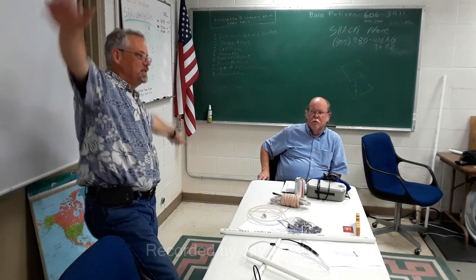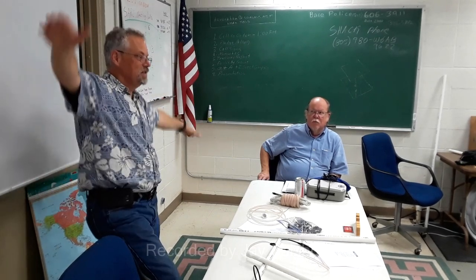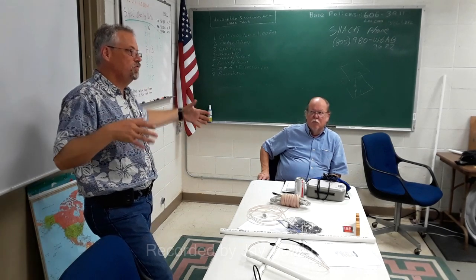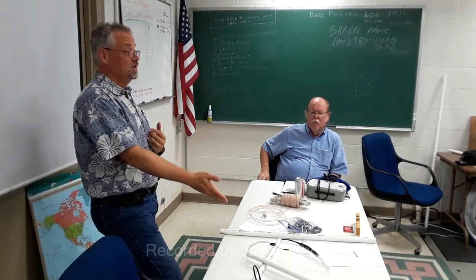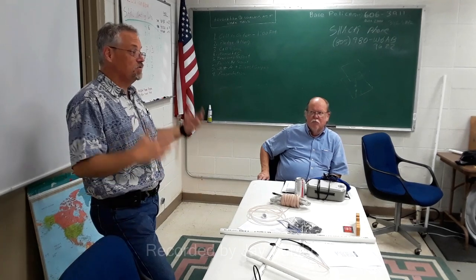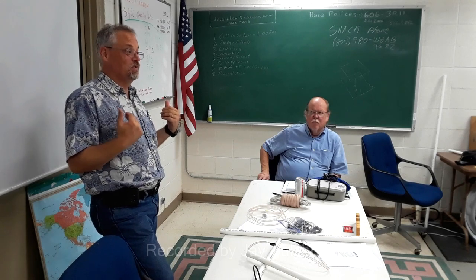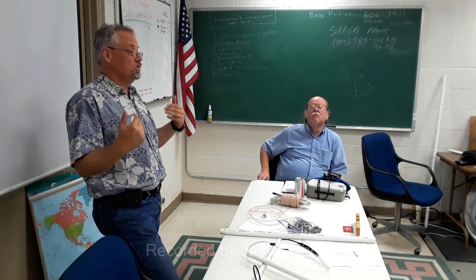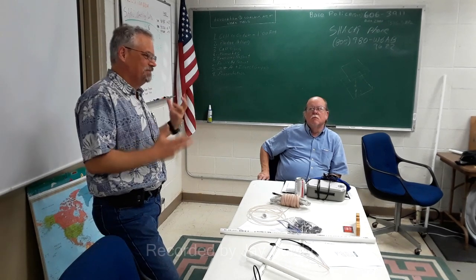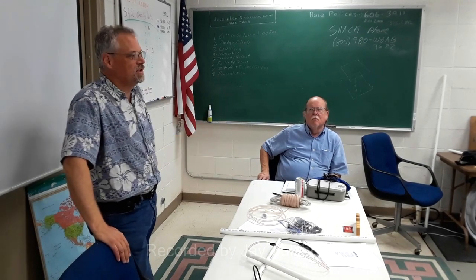That's a balanced system, okay. And if everything is in balance and everything is in tune, you should have very little to no reflected energy. But if you feed this off-center like we're doing here, now you've got the physics involved. You're potentially going to have some energy bouncing back because it's not balanced anymore. If you have it out of tune, you're going to have energy bouncing back, okay? And so that's the nature of AC going through a transmission line and all of that.